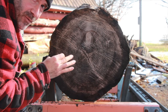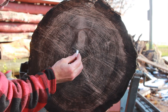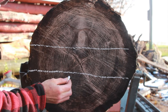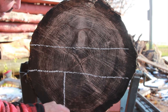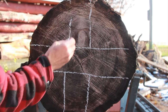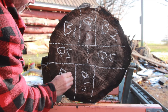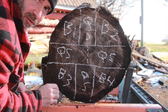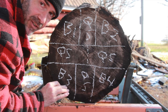This log I want to do for acoustic guitar sides, so I'm going to quarter saw. I'm going to take a three and a half inch section out of the middle, then take these thirds that are left, rotate them 90 degrees, and cut down three and a half inches this way as well. That gives me the quarter sawn here, and what's left are bolts which I'll resaw later on a bandsaw — this just gets them drying in a fairly stable condition.